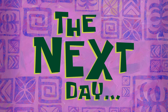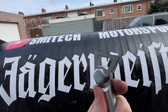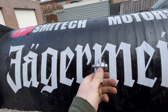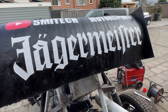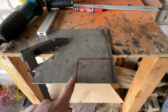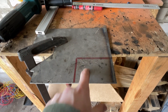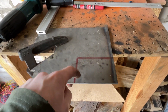The next day. The first step is to make a piece of steel plate here — these triangles will be welded onto it so they can stick on there, and the plate can just be screwed into the epoxy. This is the plate I'm using: five millimeter thick steel, 11 centimeters by 7 centimeters. This is where both mounting eyes will get welded on, and I'll drill four holes in each corner so it can be easily bolted up to the wing.